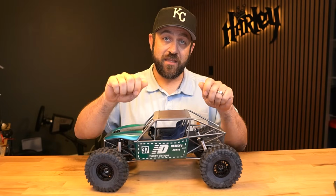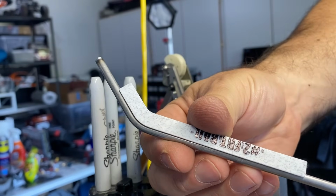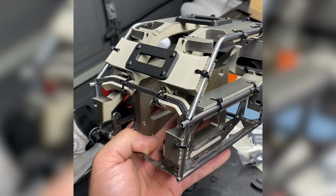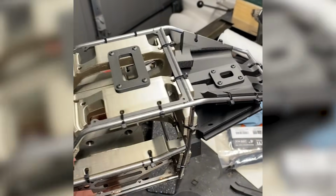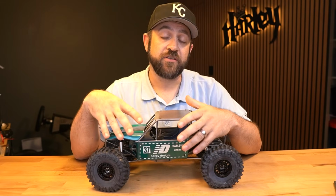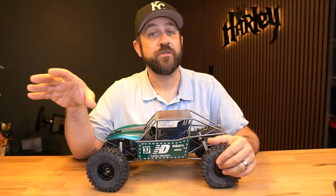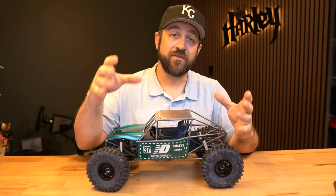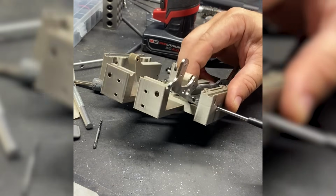So you're able to bend the tube and put it into a 3D printable template to make sure that it's going to fit properly before it goes into one of the 3D printable jigs that are also given so that you know exactly how everything is supposed to fit. And during those chassis construction stages, it also integrates laser cut parts that you're able to purchase through SendCutSend. Those also fit right into the fixtures so that, again, everything is put right where it's supposed to be.